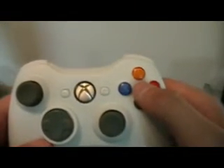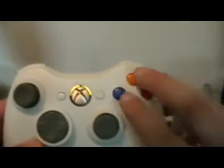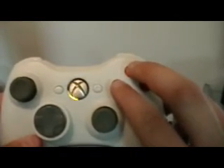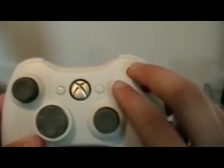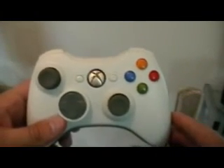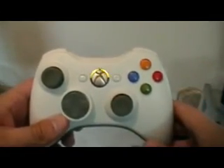The reason I like to hold the button down and see that code multiple times is for you DIY guys. Let's say you've accidentally bridged the X and the Y buttons — I'm going to hit both of these. See how it's one flash, two flashes. This is what it would look like if you had accidentally bridged a solder connection. So if you're getting multiple flashes, you've probably got problems with multiple buttons. If you're not a DIY customer and you're having any problems — a lot of flashing or whatnot — just contact support.